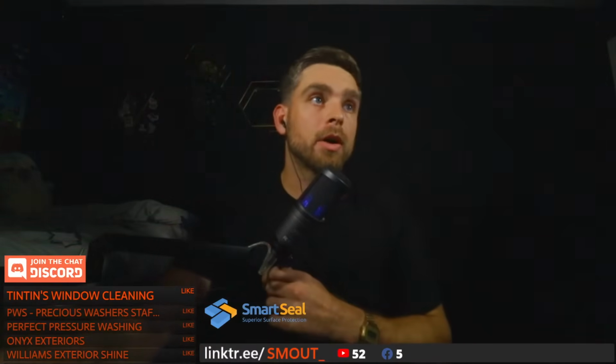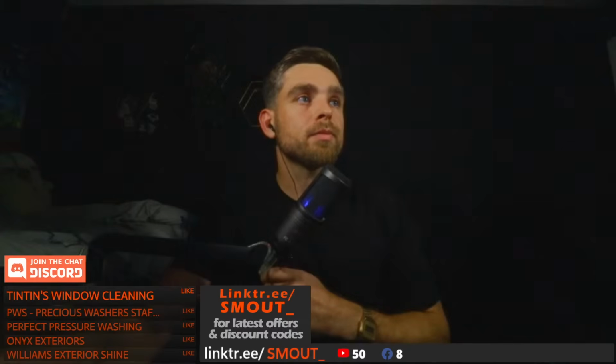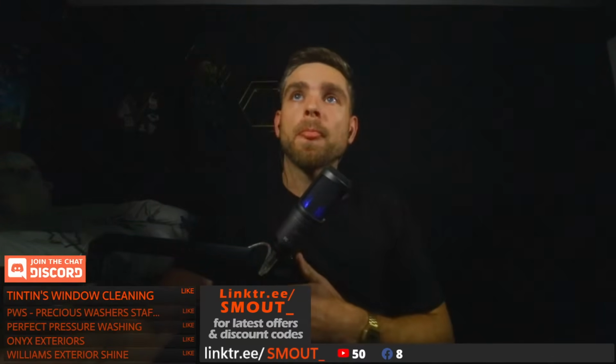So you can do a couple of things there. I don't know how much you've done so far to try and remedy it, but that could help. Also, you can try elevating the buffer tank if possible. So ideally you want the water line in your buffer tank to be higher than the inlet on your pump.